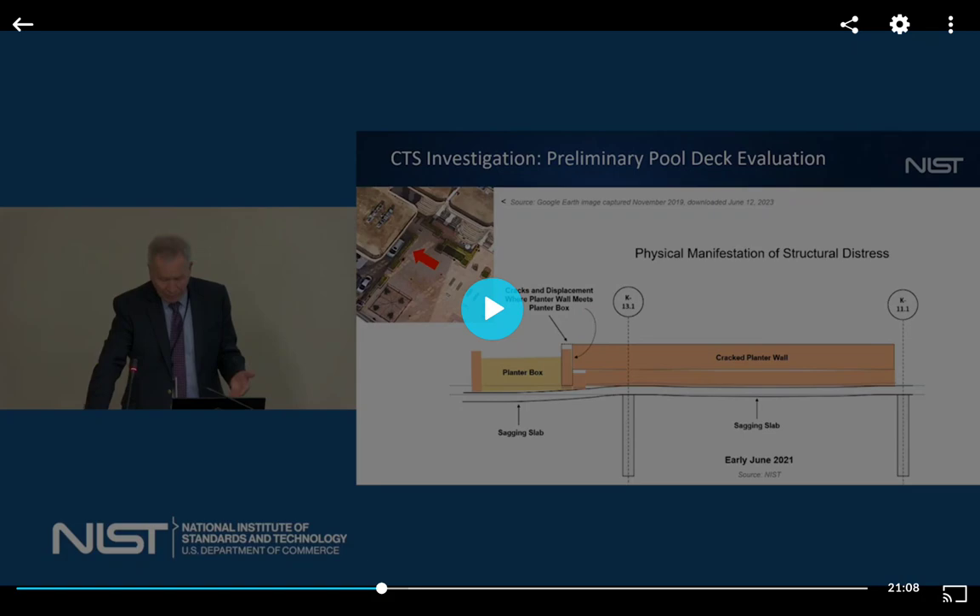This distress is consistent with unusually large slab deflections — consistent with findings of low margins of safety. He says this part of the slab has deflection — that's obvious since the thing is falling away in the image. He doesn't take a genius to say it's deflecting. But you get zero for showing the critical shear zone in great shape, because we know the whole deck — not one critical shear zone made it out. Not even at the pool deck where it came down — every one of them went ring-around-the-rosy.